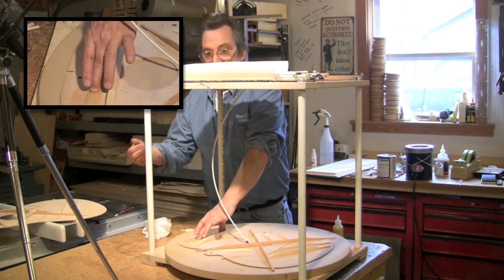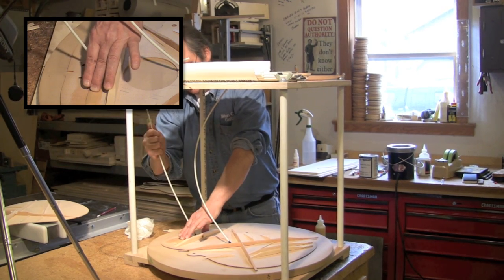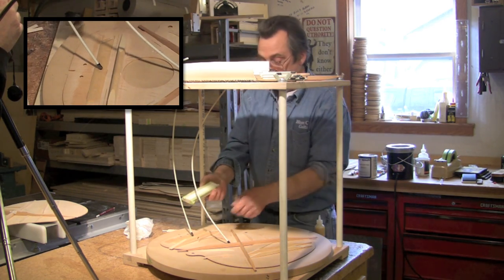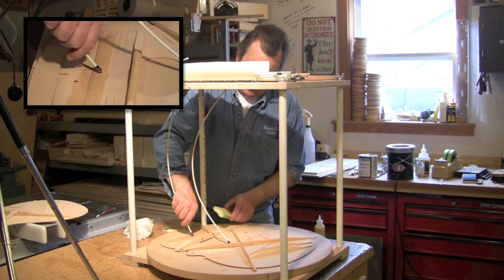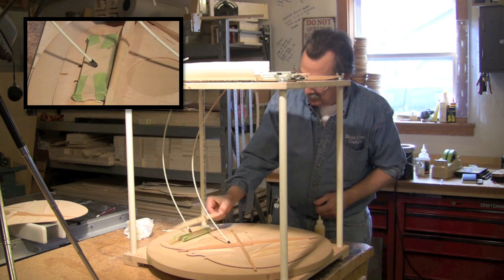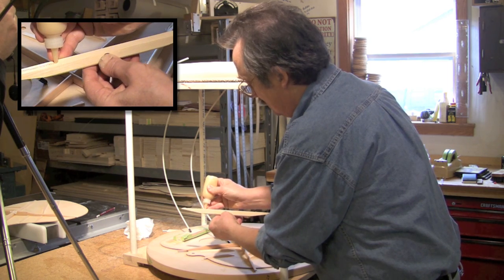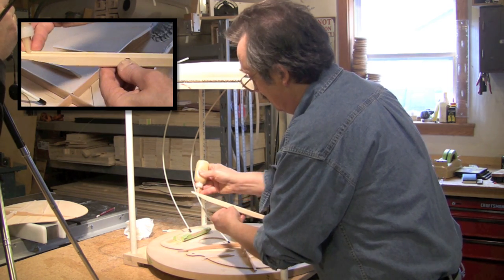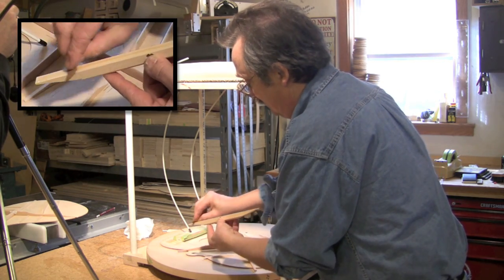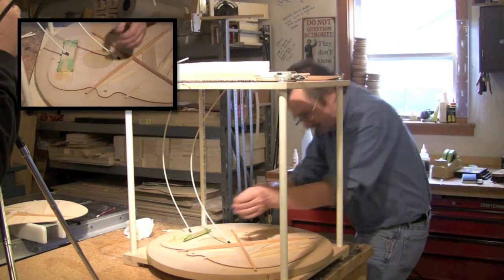I'm holding this down and I'm going to take a go bar or two and stick one right in the middle. I'm just checking that I'm on my lines, or at least reasonably so. You can see how much glue I have on here — a quick smear with my finger to get a good coating. The trick is to have enough glue to see the glue but still see the wood.